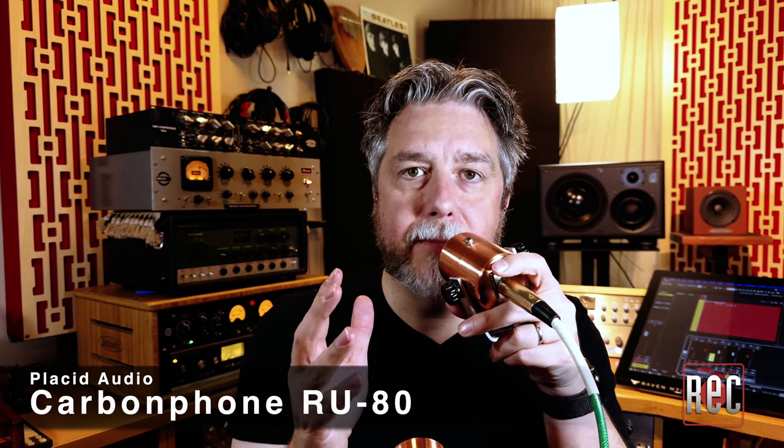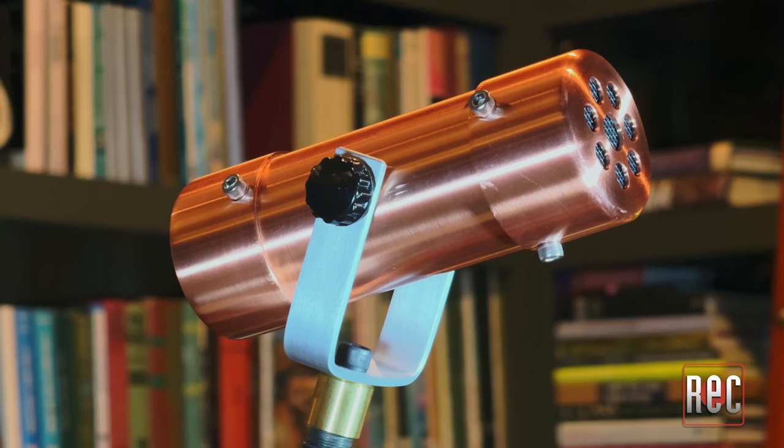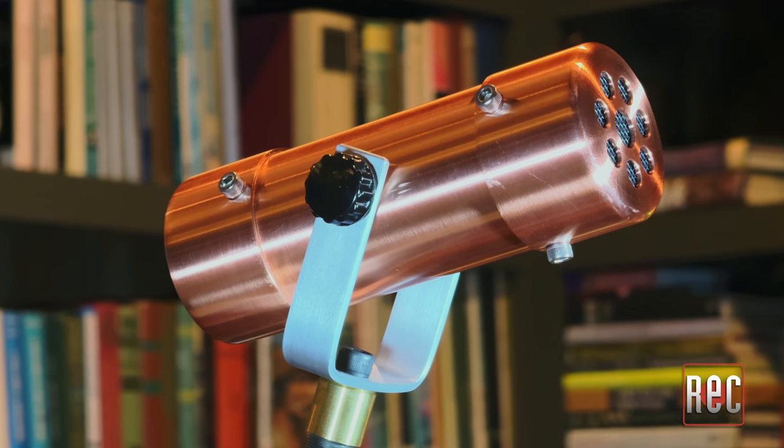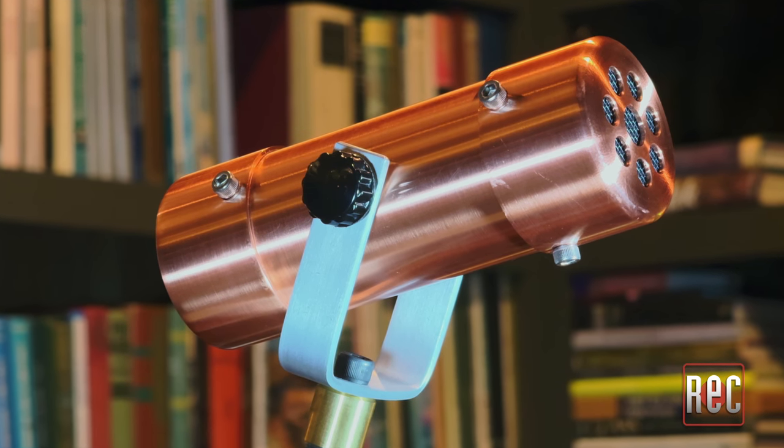Sonically, the Copperphone is mid-forward and best described as squonky. Unlike a carbon element, the Copperphone is not gritty or distorted. Rather, the Copperphone is severely band-limited, giving it a rather distant and squelchy sound with occasional unpredictable mid-range resonances. The Copperphone imparts an instant sense of old-school nostalgia to anything it captures, and pretty much any source can make use of its vintage field recording aesthetic. And the closer, the better.